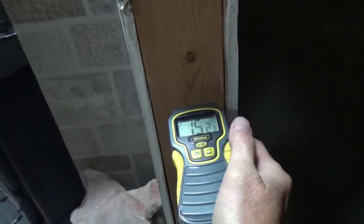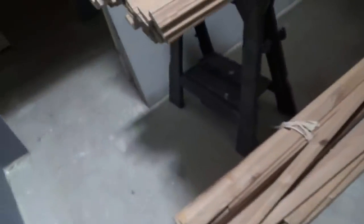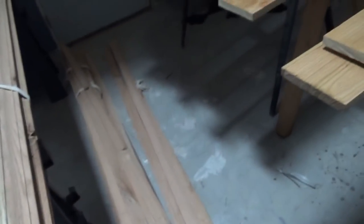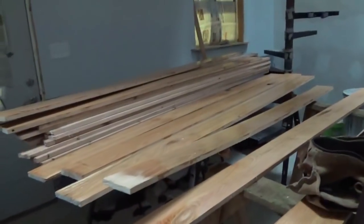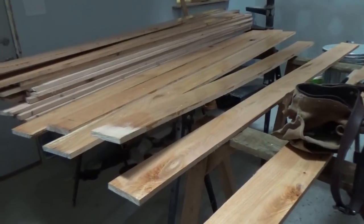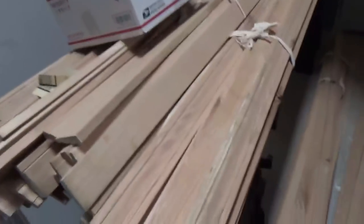And you're going to see it for the first time, and the same thing I'm seeing. So this has been sitting in here for quite a while, and you can see the moisture content in this 2x4 is 15%. Now I would expect the molding to be about the same thing, and you're looking at 14%. So it's all in that area where it's good for one another. In other words, it's good to nail this stuff up now instead of later, or bringing it in right out of the kiln, because now it's basically the same temperature as what we have in here. So splits and cracks and stuff like that and open joints should not really be a part of what's going to happen here soon. So I'm going to start working on this.